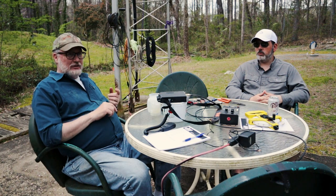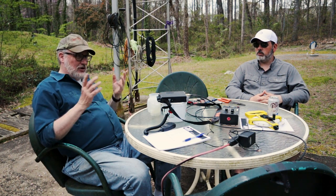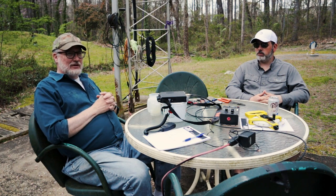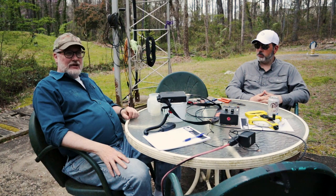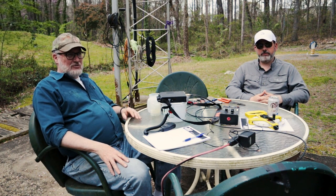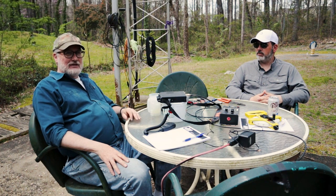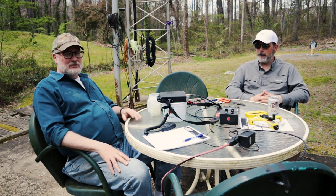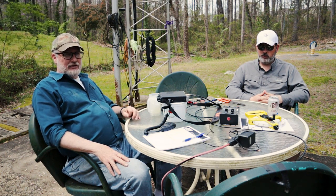So we've talked about the wire. And of course, ultimately, the antenna is fed with coax, and all hams have 50-ohm coax somewhere. And there's one more piece, and that's the matching section made out of ladder line. Standard ladder line with a velocity factor of 90%, that's a piece that's 39 feet 3 inches long. So really, you have to go find 40 feet of ladder line. Probably that would cost you, I don't know, $12, $15, $16, plus shipping from any of the vendors that you might find on the internet. You can certainly find it at any hamfest at a very reasonable price.